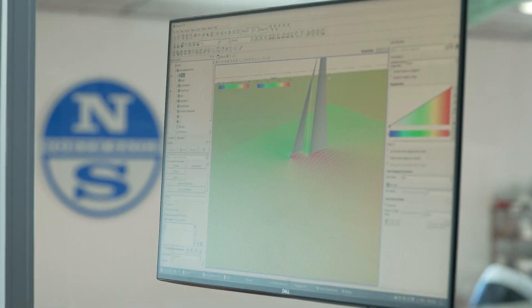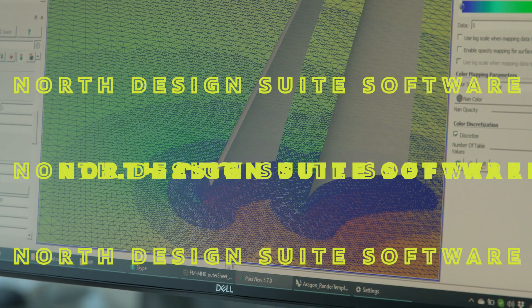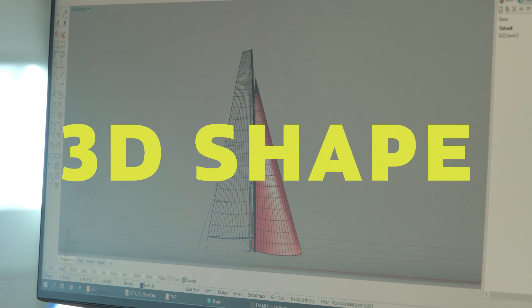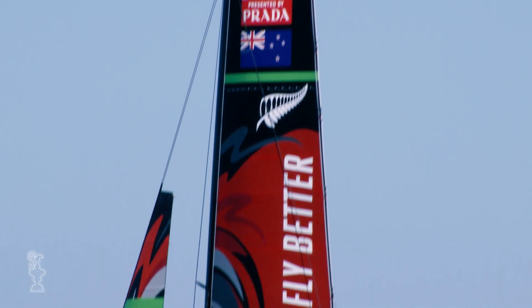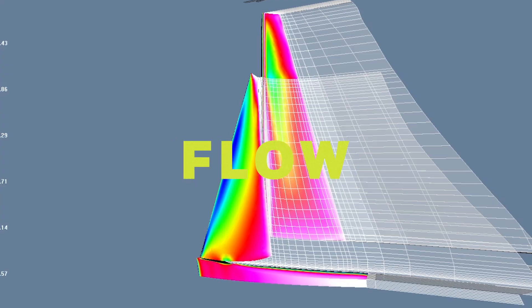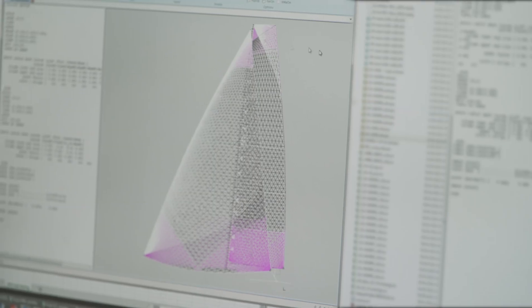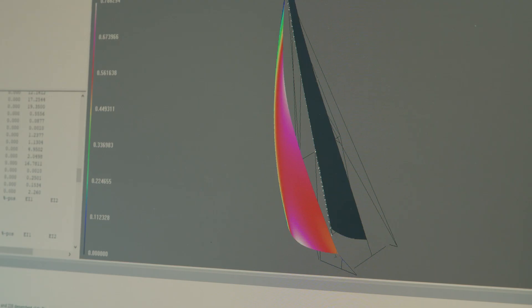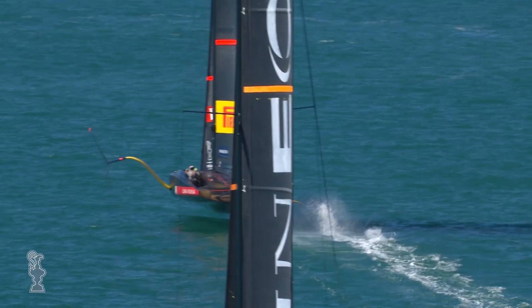The engine above deck is made possible because of the North Design Suite software. The design suite is a powerful piece of software that is able to build a three-dimensional shape of a sail and rig, to determine the flying shapes, the stresses and the strains going on in the sail and rig. The North Sail designers working on the AC75s rely on five different programmes: Desmond, Spiral, Warps, Flow, and Membrane. The data from these five programmes help the designer make very confident decisions with their sail designs right from the start, bridging the gap between concept and reality.